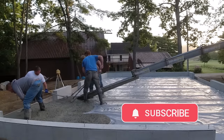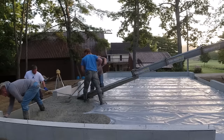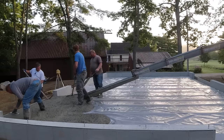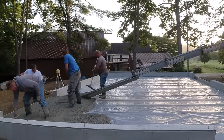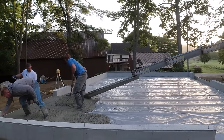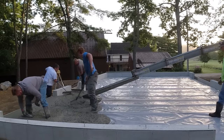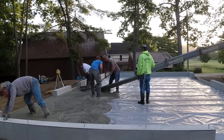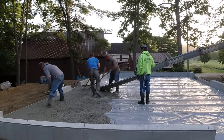We're working for the guys that did the concrete walls. Usually the general contractor will hire them if they're not the general. The general contractor will hire the excavation company, the guy that does the dig-in, the backfilling, and he gets the sub-base prepped. Then we come in and lay down the plastic, snap our grade lines, put up our forms for the garage doors, and pour, finish, and saw the concrete. We kind of come in on the tail end before the building starts and get our part done.